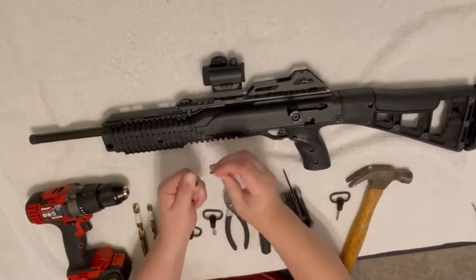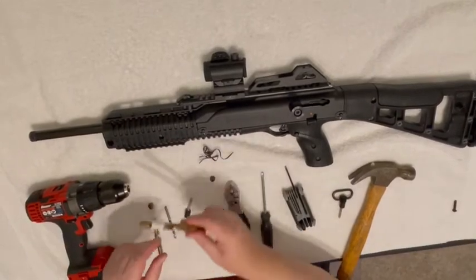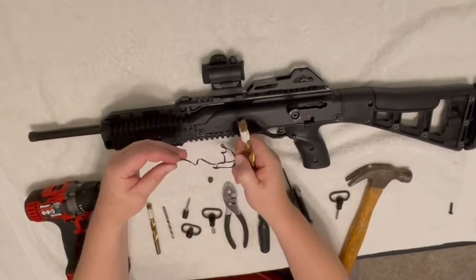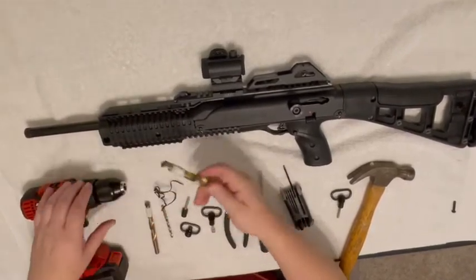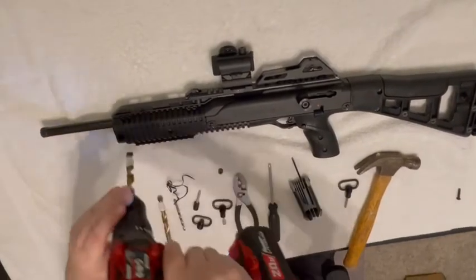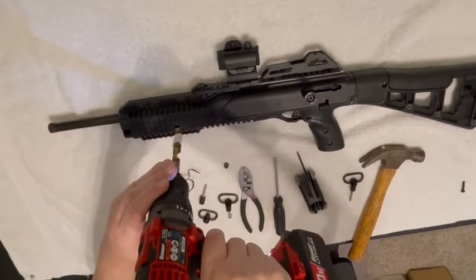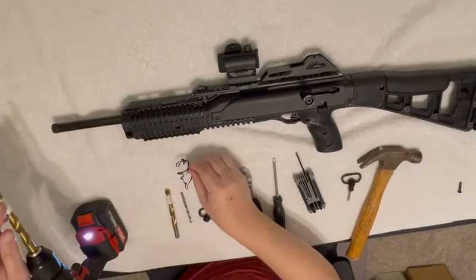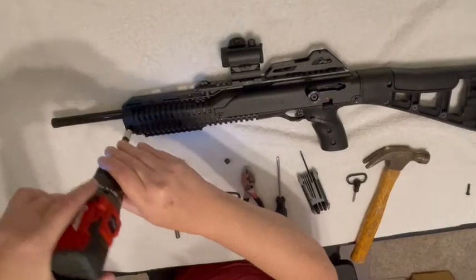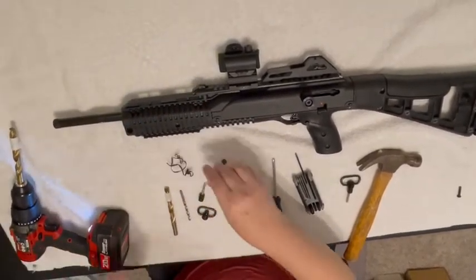We're not going to reuse this. When you drill, you've got to be real careful because it makes long tendrils — as you can see it doesn't make chips, and it will pull the drill bit in really fast. So when you put it in the drill chuck and go to make the cuts, just pulse on the slowest speed. Then once you reach the depth of the tape, you'll see when you're there — then pull your tendrils out of the way.